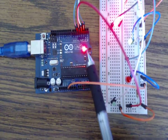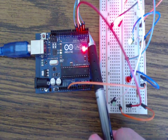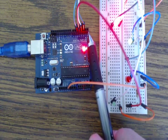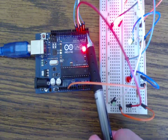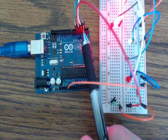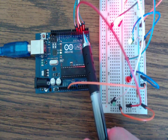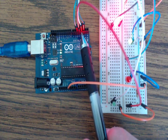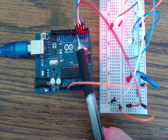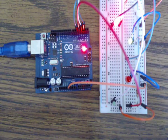I didn't use pins zero and one — I've left those open, and I'm going to do that in my build as well when I hardwire everything. Those two pins have other functions and don't work with what I've set up here. I set up camera one with pin 2 and pin 3 — pin 2 is the red light and pin 3 is the green light. Then pin 4 and pin 5 run my second camera.